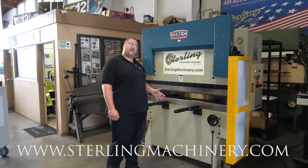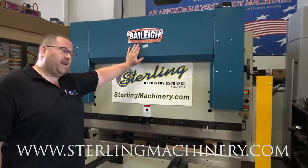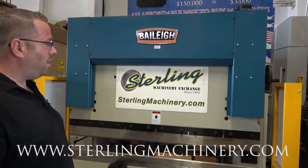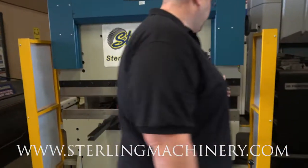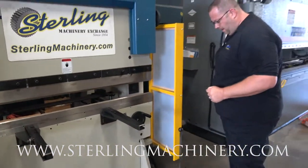Today we're going to go over a really nice machine. It's made by Baileigh Industrial, probably one of the biggest makers on the planet right now. It's a 33 ton by 5 foot overall hydraulic press brake. Very simple to use. It's got light curtains in here for safety. If you get your hands into the wrong position, it'll shut it off.